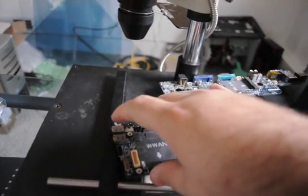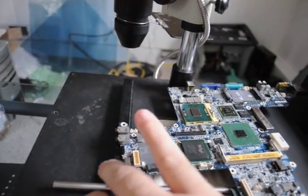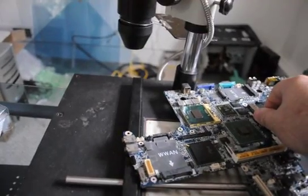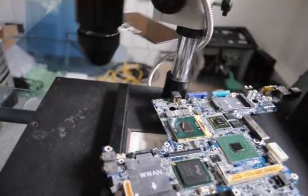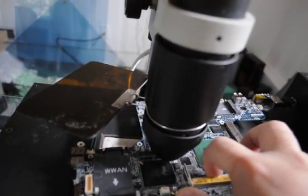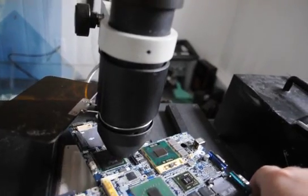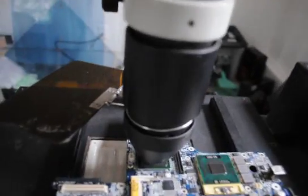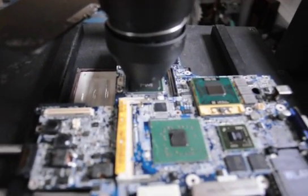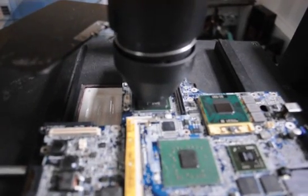So now we're going to try to position this and get it to do what it needs to do. I'll probably have to move these legs in — it's kind of hard to do this one-handed, but it happens. Let's see if we're close enough. Not quite. I'm probably going to have to position it this way. As you're readjusting it, make sure that you allow the heater to actually hit the chipset from the bottom for a certain amount of time. What you don't want to do is go without the chipset being heated from the bottom, because it will cause the board to flex and cause issues.